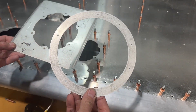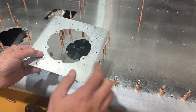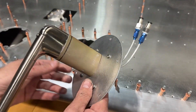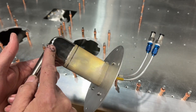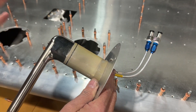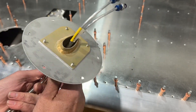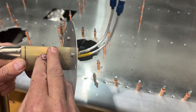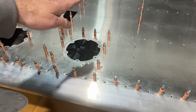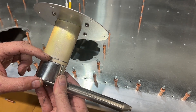This would slip up under the skin — and don't forget this ring, which would fit right in there, then slip up under the skin and get all clecoed into place. Now, this is the Dynon pitot tube with the AOA — the non-heated version. The heated version would be the same, just with a heating element and a power wire. This is the Dynon mount that you can get, and I made some modifications: I cut it shorter — it was really long, no need for the pitot tube sticking way down. I cut maybe an inch and a half off, and honestly I probably could have cut another half inch.